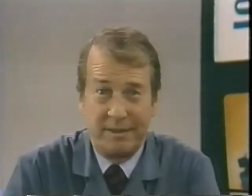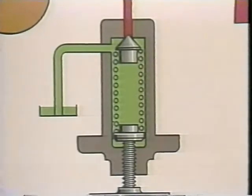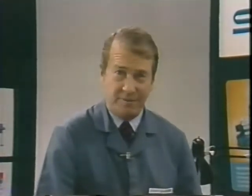Pretty simple, and it is, but let's take a look at that spring. If the area of the poppet seat was only one quarter of a square inch, and we wanted a pressure setting of 1,000 PSI, our spring force would have to be 250 pounds. Force equals pressure times area. That means it could support one-eighth of a ton without compressing, and that would have to be a very stiff spring. Now let's go back to our circuit and assume we have a 1,000 PSI setting on the valve and a gradually increasing load on our cylinder.